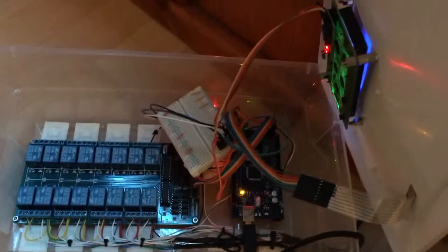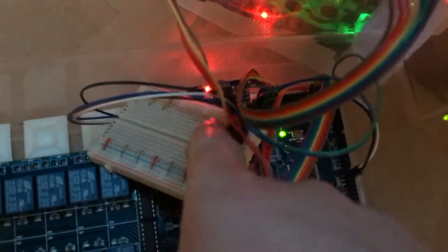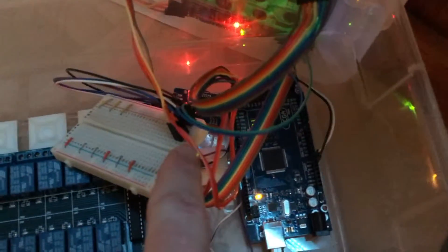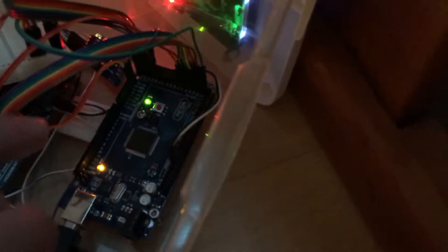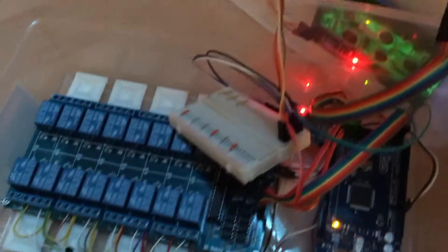Here's inside of the box: an LCD module, and an RTC real-time clock down there with the little red light. I'm using the I2C connections for the display and the clock, so those are in sync on the Mega board. The breadboard basically ties them together.